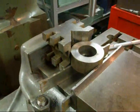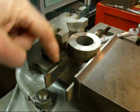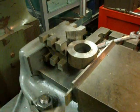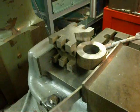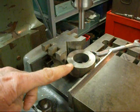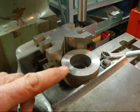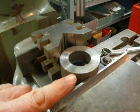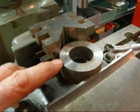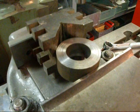Notice how I'm holding this now. I do have a v-block which is kind of big and klutzy. We've got a couple of parallels under there because when we bore this later on we don't want to hit the bottom of the vise nor do we want to hit the parallel, so the parallels can be pulled out like so, and boring doesn't put much pressure on us so I don't believe that it's going to move. But one other thing to be careful of here: when you're going to bore something like this, if it has thin walls, be careful you don't crush it and bring it out of round — then when you bore it you're going to bring it into true round again, and when you release it in the vise it's going to spring out of round and it's going to be in an elliptical or oval shaped hole.